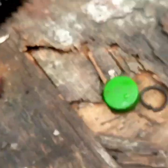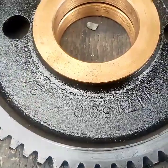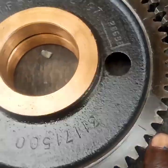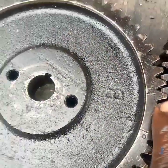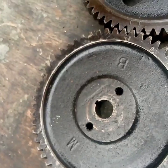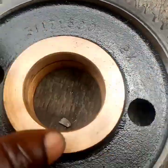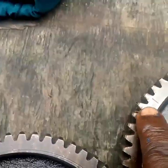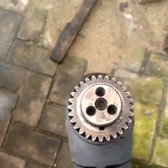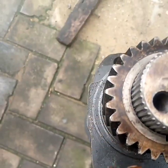In case you cannot see any marks, you can try to get another gear, but if you cannot, you can mark the gear yourself. In another video I am going to show you how to set injector timing when you don't have timing marks on your gear teeth. There is a way to go about it and your engine will still give you what you want.